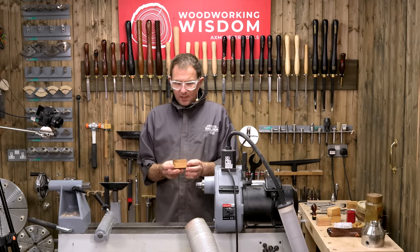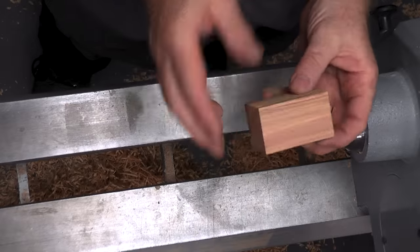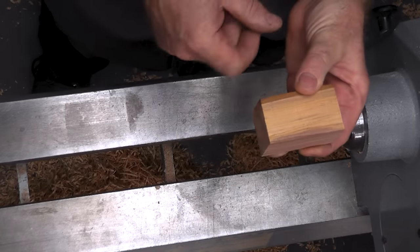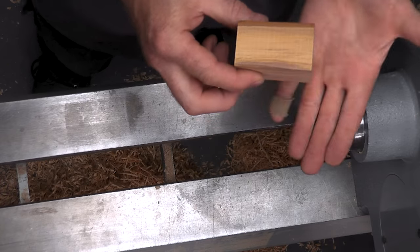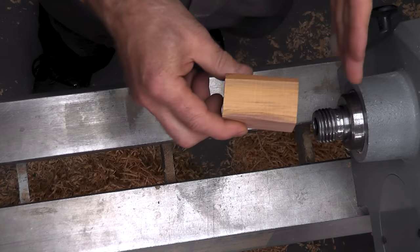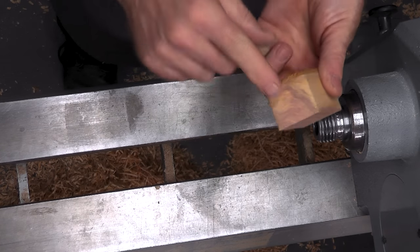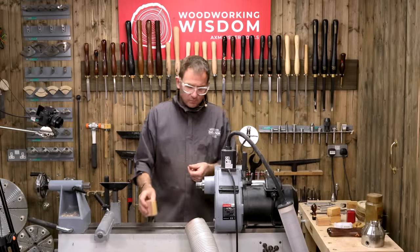Now, okay, so how would you want to cut them? First of all, I tend to like using my bandsaw at home. It's easier, it's more accessible. So I get these out and cut them on the bandsaw. Doesn't mean things are always square. But I do tend to try and use either a cross sledge on the bandsaw table or something with a right angle corner as a good push block to try and keep it square. But we've got to get the end nice and square to drill the hole.